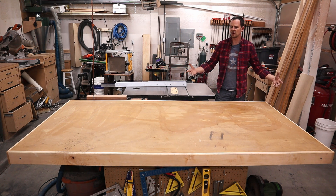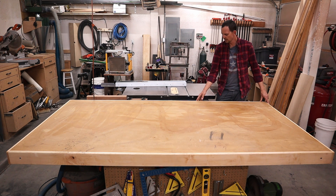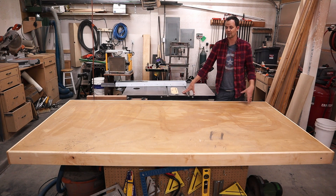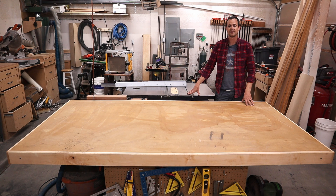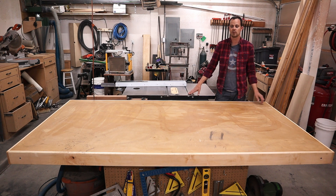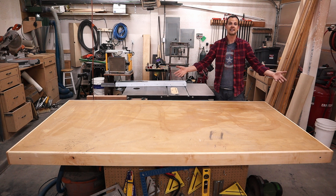A couple things in retrospect: I would not use oil as the finish on the MDF, and definitely use hardwood edging. I've dinged into it a little bit and got a few scuffs, but not like my old one that was done in pine — that just chipped apart. I'm really happy. It stayed relatively flat; the dip area was only about four thousandths over two feet, which is perfectly fine for woodworking. Just a couple of sheets of MDF and you can build this huge table. It's very light, so I'll put it on a base with some wheels. I hope this was fun to watch — thanks for watching, take care.